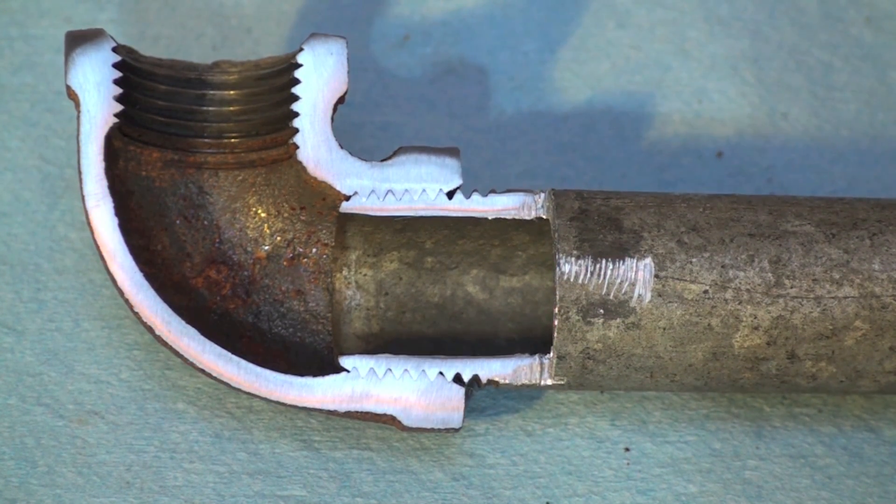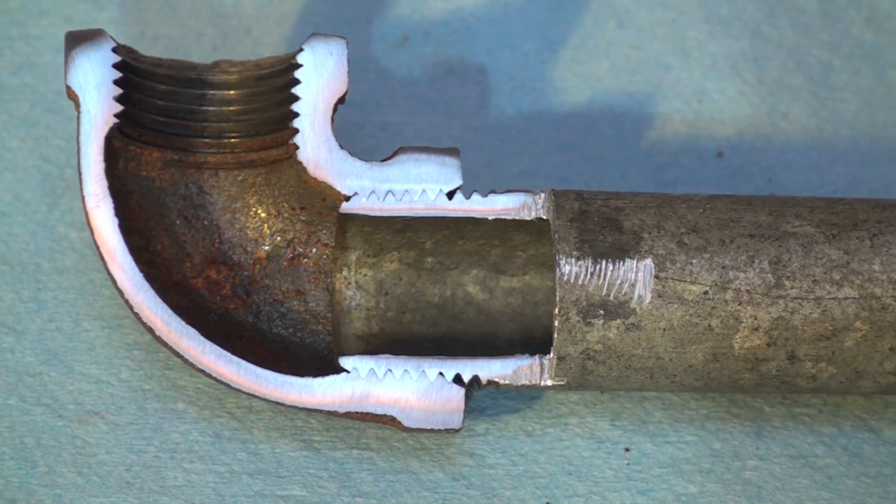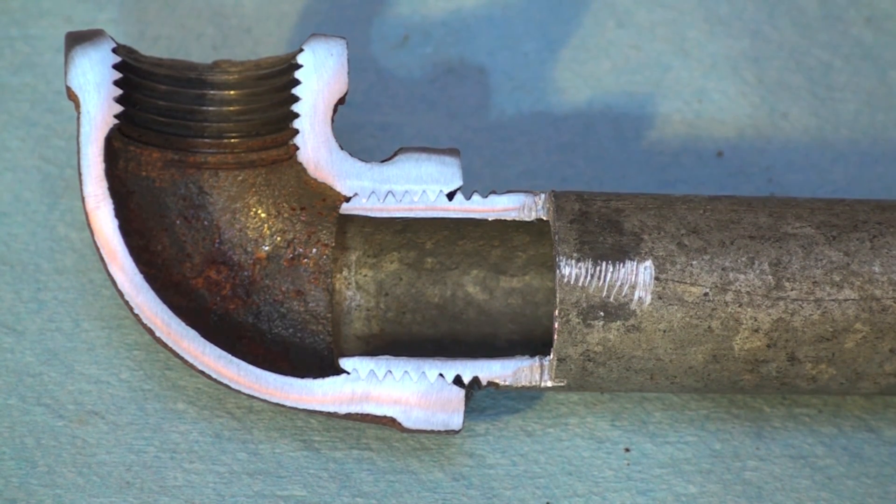Will these things seal without pipe dope? Actually sometimes they will, but I would not do it — pipe dope is there for a reason. I don't champion any special kind of pipe dope; I think most of them work. Teflon tape I'm not real thrilled with because it just doesn't seem to do what it says it'll do. A good grade of pipe dope — just put it on and go for it. You can spend incredible amounts of money for little tiny tubes of super pipe dope and they'll seal about the same as the cheaper stuff.